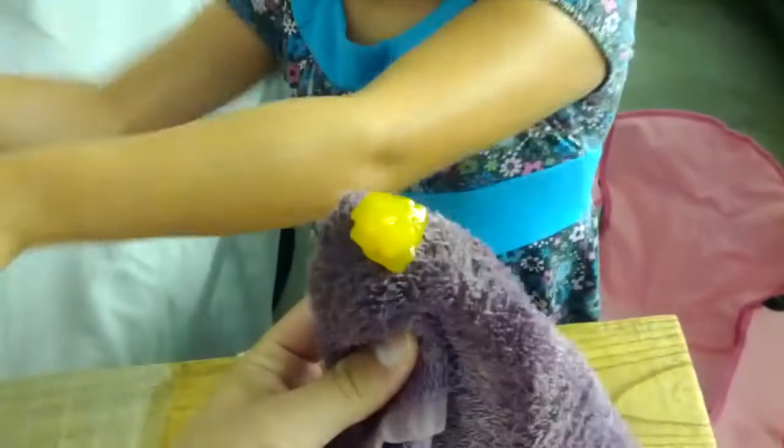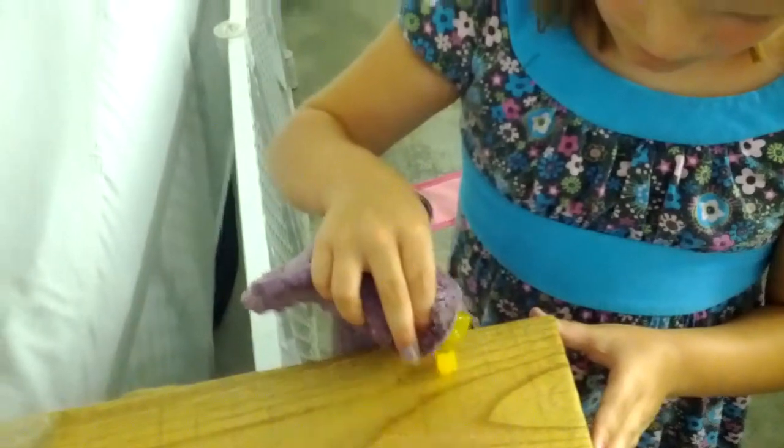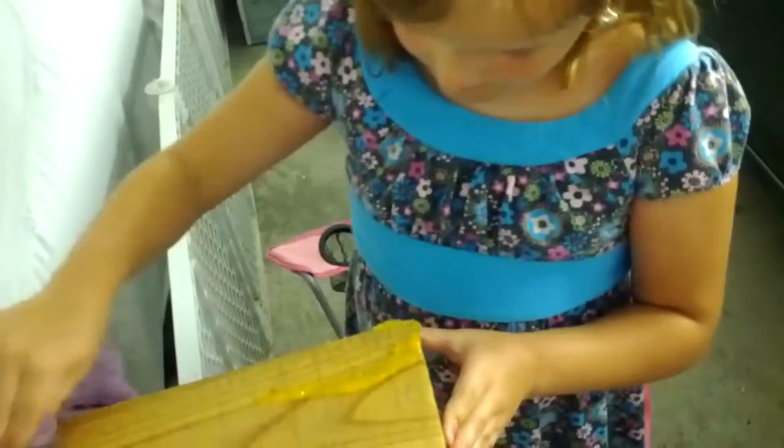So Matt, you want to take the cloth and we're going to wipe it with the grain. We're going to stick it down here in this corner, right here. Put it all in and you're going to wipe it back and forth. Make sure you're getting the edges there. What we're trying to do is get that into the wood.